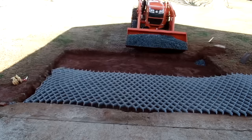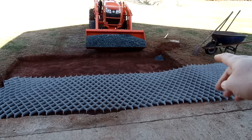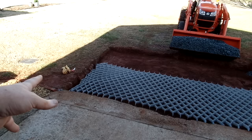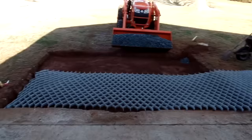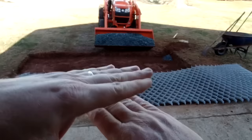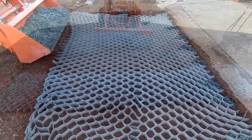You can see here I'll need to cut the grid, which was the plan. I'll cut it and take that half and put it over there. I did need a few more spikes than I thought. I need to put a couple more in there. So what I'll do now is cut this here, add that section back over on the other side, and when we start putting gravel on we need to add it in the corners and different places — because again, we want the ground grid flat on the ground. We don't want gravel to get under it and push it up. We need good contact.